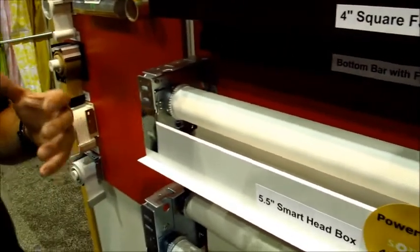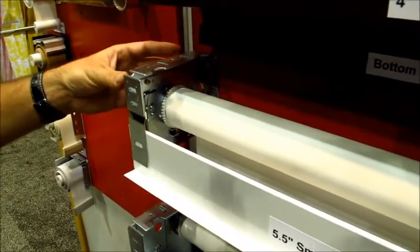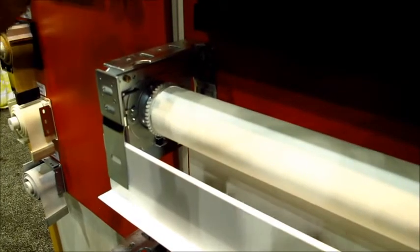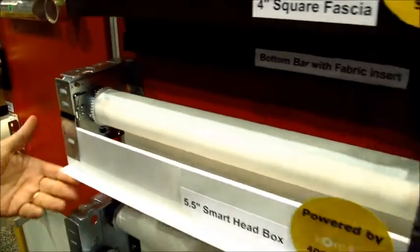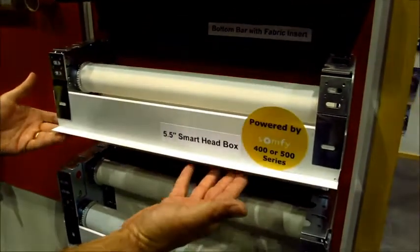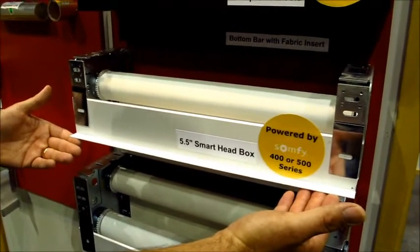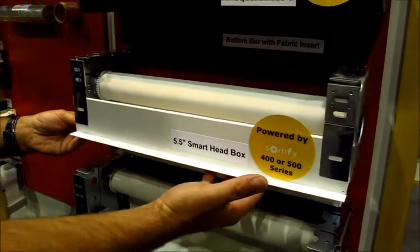Here they've eliminated the need for the expensive box. What you have is two end brackets that you mount up first. The shade gets mounted inside of that, and then you have an attachable lower plate that goes up inside. You have the front plate that takes care of the ceiling tiles, and a bottom plate that serves as your access flap.